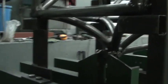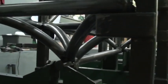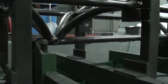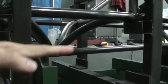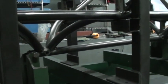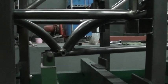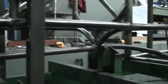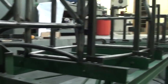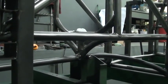What the keel does — if you look up from the front — is it gets the bottom of the car out of the way of the front spoiler, so that air can flow with the front spoiler really smoothly and get maximum downforce. The front spoiler operates in ground effect, so it's very, very effective — you get several times the amount of downforce you'd expect from it. So it's really important to keep it operating well. The whole rest of the car is designed to try to generate enough downforce at the back end to equal the front end.